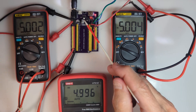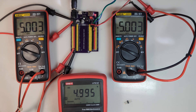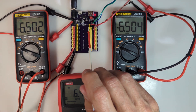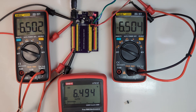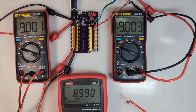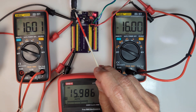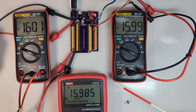We're coming in with 5 volts from the power supply, which is actually less than the 6.5 to 16 volt range printed next to the barrel jack. Now I'm going to increase the voltage to 6.5 volts - and now we're getting 6.5 volts everywhere, including the 5 volt input pin to the ESP32. Increasing to 9 volts - everything reads 9 volts, which would fry your ESP32 by providing too much voltage on its power supply pin. Taking it up to 16 volts - everything reads 16 volts. I'm not sure why they included this barrel jack with this voltage range, but I would avoid using it because it's not safe for your ESP32 supply voltage.